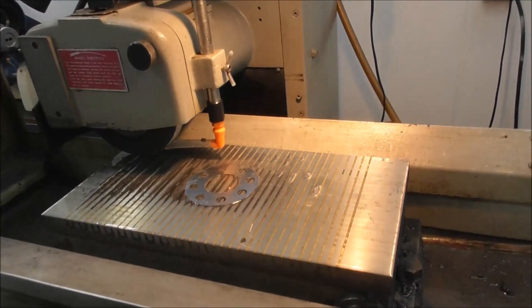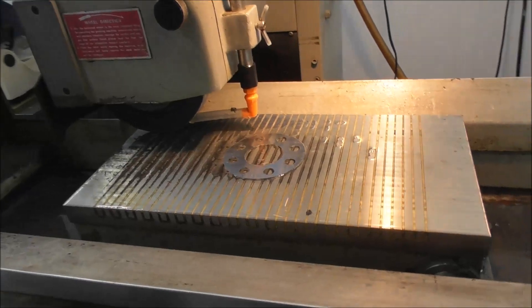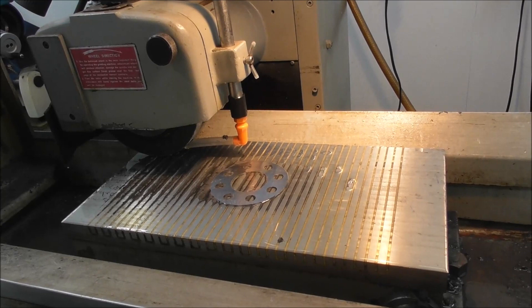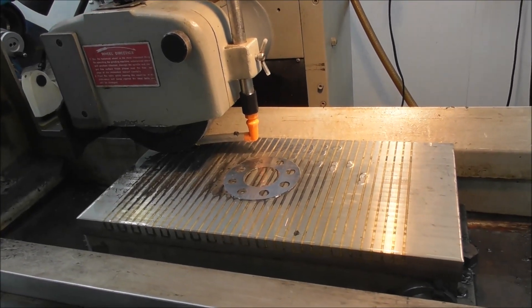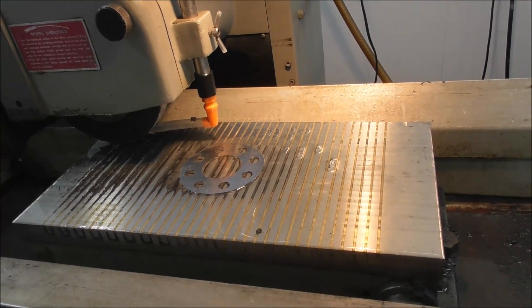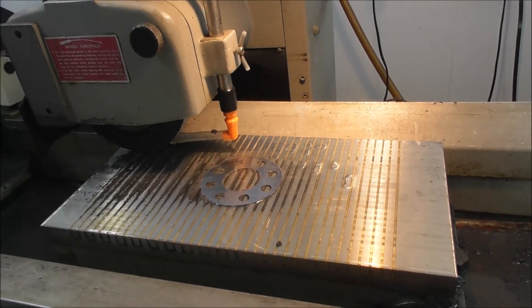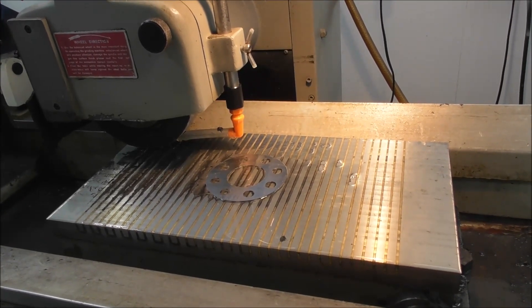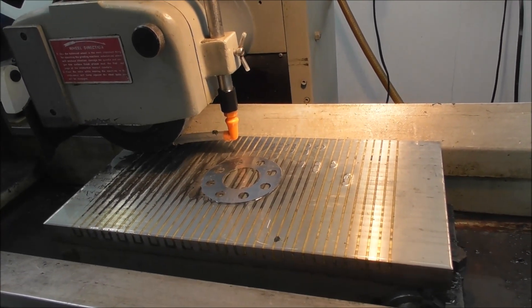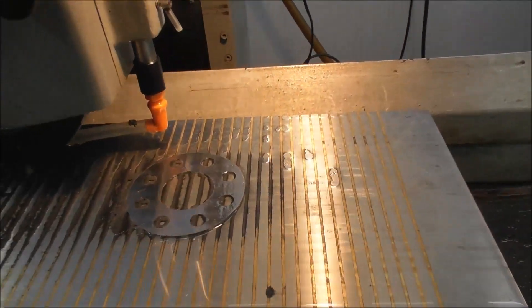As you can see, this is a manually operated surface grinder that I've had for decades. I think for most small shops that aren't doing production surface grinding — only occasional surface grinding — this process is fine. You soon learn a rhythm of swinging the longitudinal and cross traverse, and usually it's only a few minutes to surface grind your part. There's little advantage in having the process automated with motors on the slideways or hydraulics.